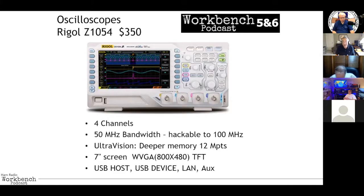And that's perfectly fine. So why is a 10 megahertz scope good enough? The reason is that if you're looking at audio, what's the highest audio frequency you listen to? 3 to 5 kilohertz. And if you want to oversample that, look at harmonics, you're looking at 10, 20 kilohertz, you'll never hear it. I think a 10 megahertz scope is more than adequate for a 20 kilohertz signal. If you're looking at digital signals, let's say on a microcontroller, a digital signal that turns on a relay is at no speed. So anything will work. A voltmeter would work.